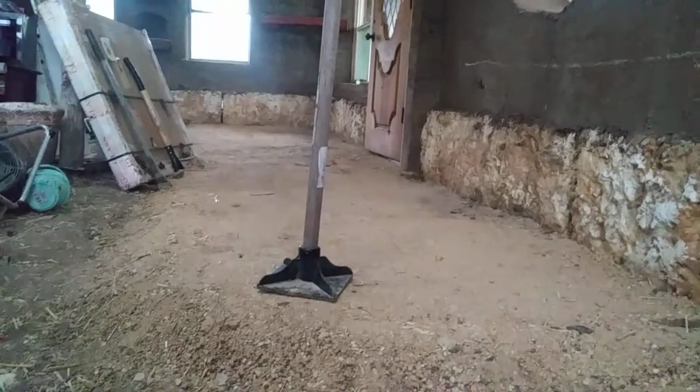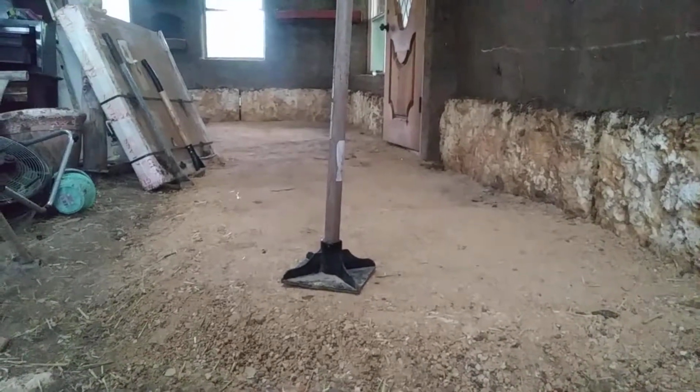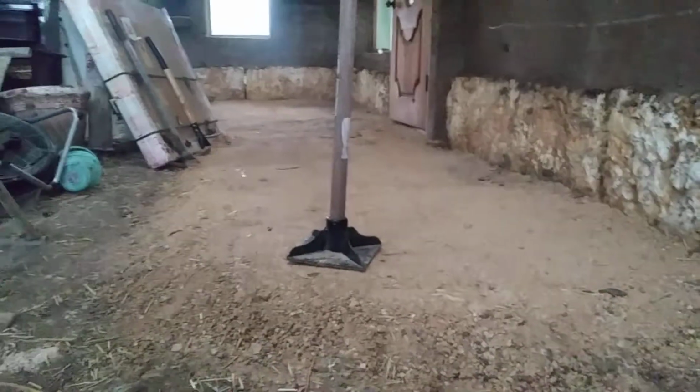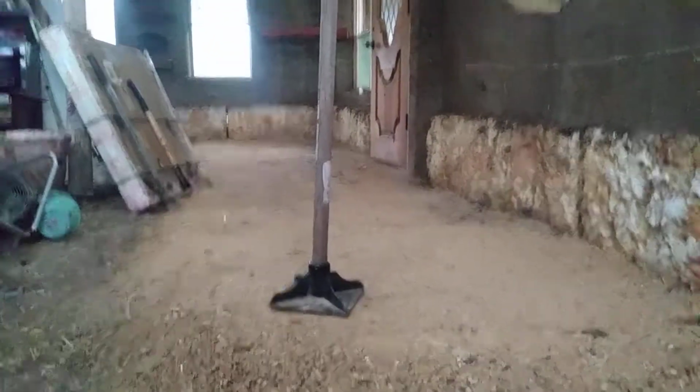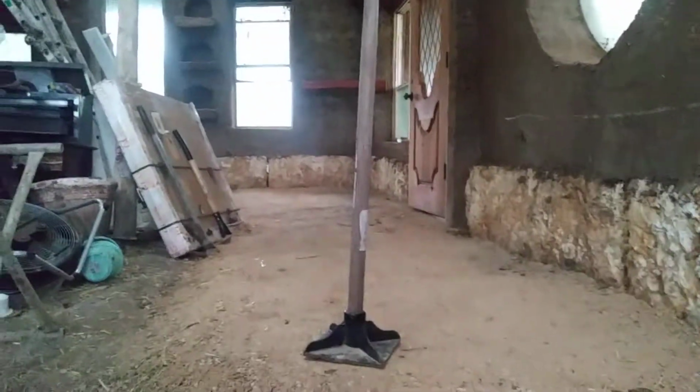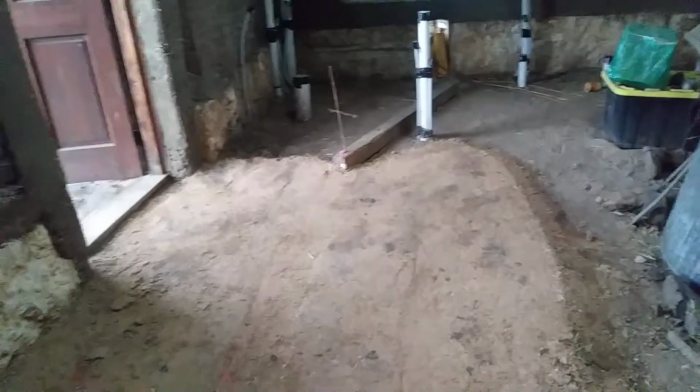I put the caliche down, leveled it with a rock rake, and then I tamped it dry into place. I came back with a sprayer, and I got all of it wet, to where there was a little sheen on top. I let it dry for a few hours, and then I came back and tamped it again. That's as far as this part has got. This part has then, once again, dried so much, I came back and I tamped it a third time. And that makes it extremely hard stuff, and a really, really good base.